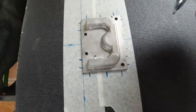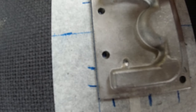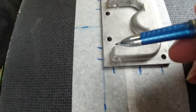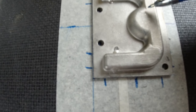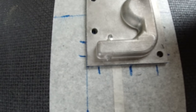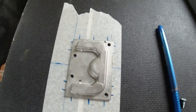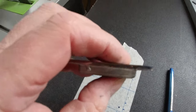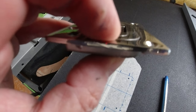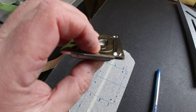I've lined this up and put a pencil mark where the screw holes are going to go. I've also done by eye, just put a line equivalent to that inset there and then the same there. What I'm eventually going to do is route out this area here on the actual ply. And then once I've done that I'll make sure that it all fits. I then need to rout out or chisel out the edge of the fitting so it fits flush - it looks like it's 2mm, it might be 2.5mm.